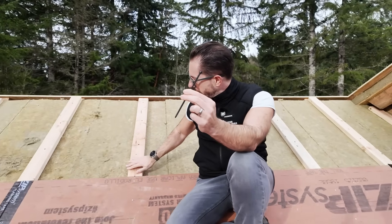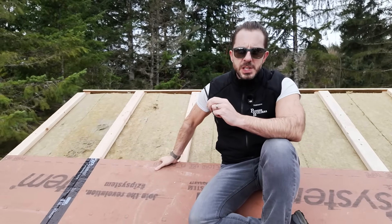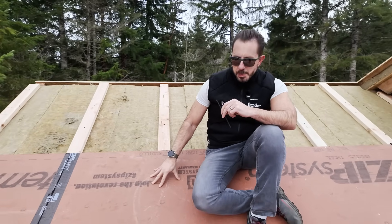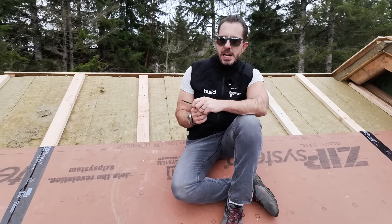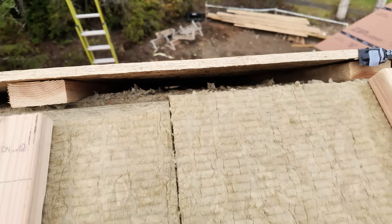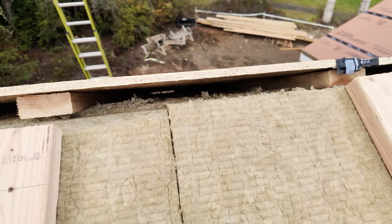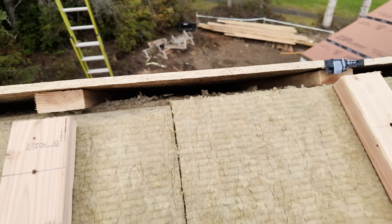We've got our 2x4 on top of this. It looks sort of like a rain screen if you've seen that before, but this isn't really a rain screen. On top of the zip is where you specify your roof cladding — that's what handles the rain, really your asphalt shingle. This is more to make sure that you don't have any water vapor that could eventually start to collect, because if that collects enough you're going to have issues with mold and rot. That's why you have roof venting to begin with.